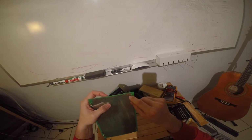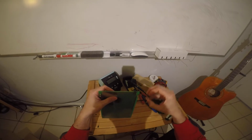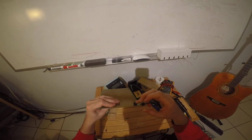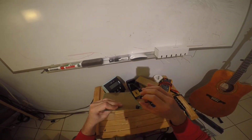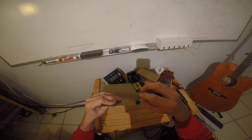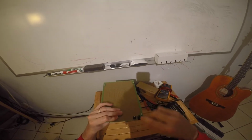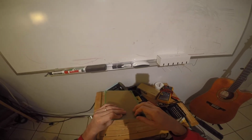So we're gonna solder this guy on, all right, and then we're going to connect it to the input. We're going to connect the 12-volt pin on this barrel connector to the input pin on my 7805. Okay, and that's going to go kind of like right next to it. So we'll keep that stuff over here on this side of the board, far away from everything else.